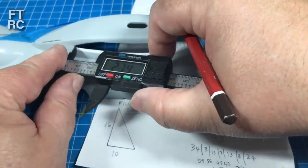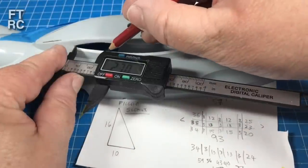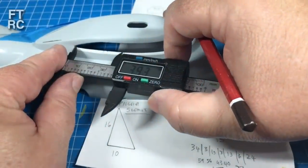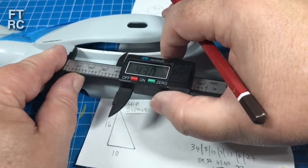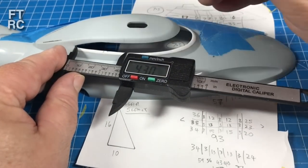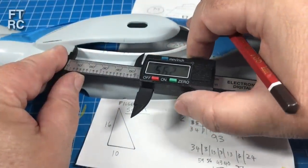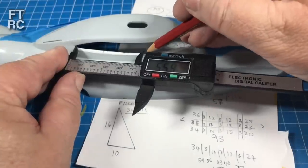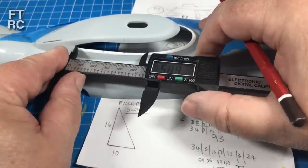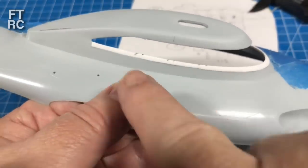Now, it's a straight line measurement, so just straight across. It doesn't go around the front. So marking those in, there's the first pillar and second pillar. This sort of vernier caliper thing, they're really handy, because it's so hard to hold a rule there and try and get all these things happening. So getting as close as I can, obviously the pencil is going to be within 0.2 of a mil, if that. There are all three. One, two, three.